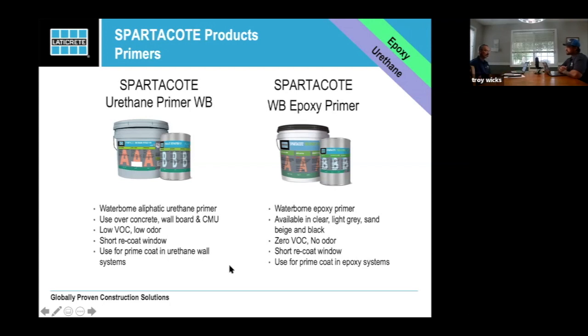I think Dan Welch is still on here. Dan, you'd made a comment, and I wanted to point this out. So we do have a system where we're using the urethane WB primer over self-levelers. And that is one of the things that we're pushing out for trials right now. It's performed well in our R&D. So that's where this urethane primer right here would be something that you'd use on question four. That would be what you'd use over the top of an SLU, and we can discuss that more if you guys decide to go that route.